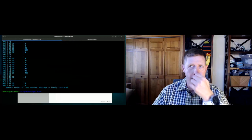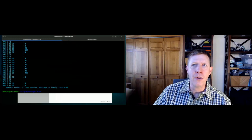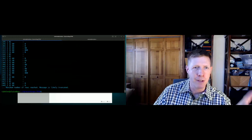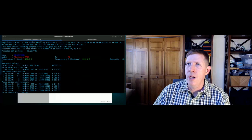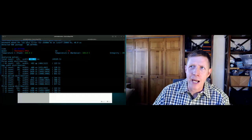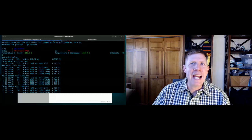But this is cool. So it says, okay, I have a total count of pulses. So this thing's amplitude modulation, so it's on-off keying probably, or something similar. So how many symbols were there? And the symbols are ones or zeros. Like how wide were they, by milliseconds or nanoseconds? You know, take a guess at what it is.